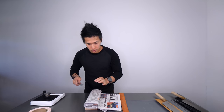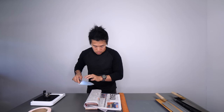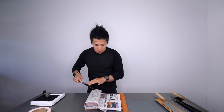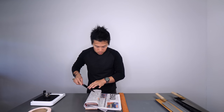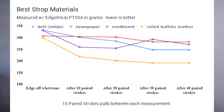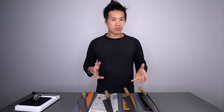The newspaper was a little surprising to me, because everyone talks about how great it is as a strop. I think newspaper would do fairly well if you had a knife polished on a 5000 or 6000 grit stone. I just think newspaper doesn't have the capacity to pull off materials on a relatively low grit sharpened knife. Ending at 282 from a starting point of 308 — not so bad, but not far enough. Newspaper, to me, is not a great viable option for a strop. If you have it laying around it'll do okay, but don't expect it to do anything more than clean off your edge a little bit.